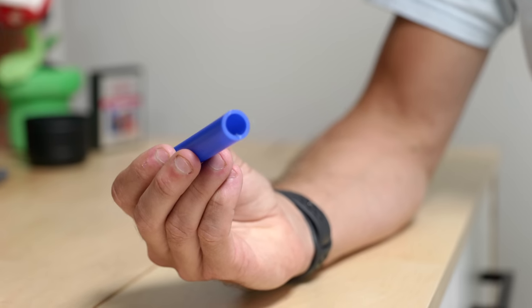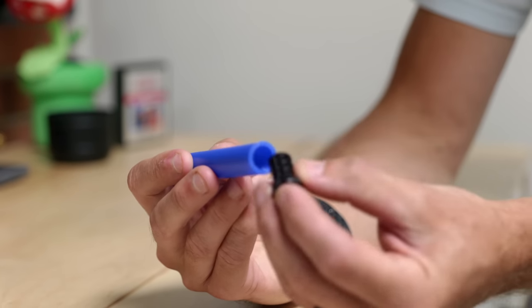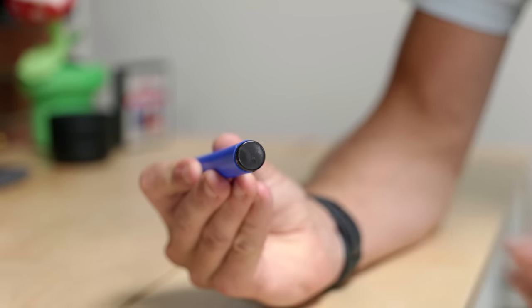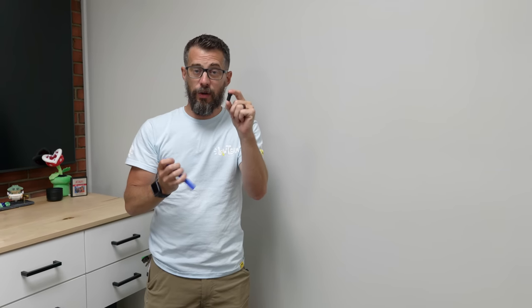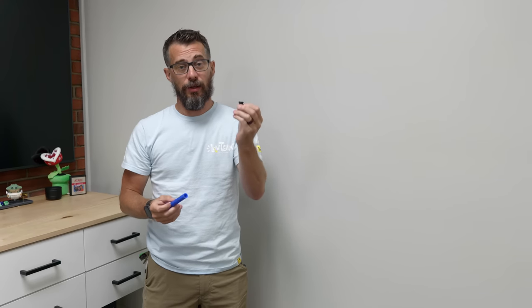You can actually buy caps that go into this pipe, but the outside head of them is the same diameter as the outside of the pipe, so that actually wouldn't do us any good. It would not stop them from being able to fall out. So instead, we're going to take some measurements and then 3D print our own with a bigger head on them. But we need over 2,000 of these things. So after we model that, we're gonna set up several 3D printers and print a whole lot. And in the meantime, I'm gonna go cut over 1,000 pieces of PEX.